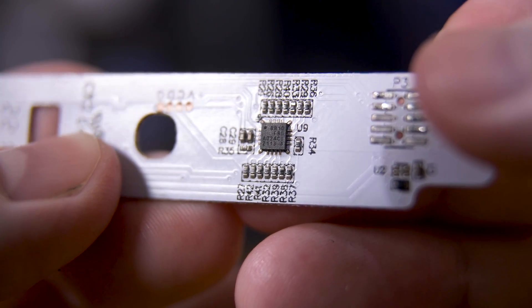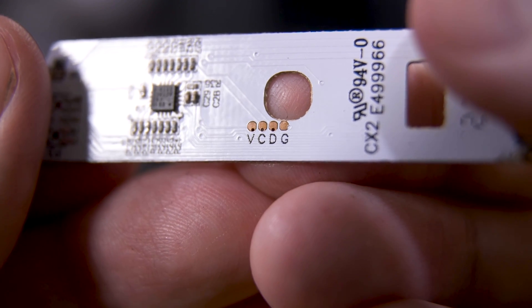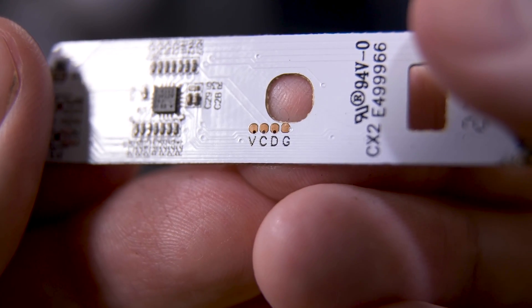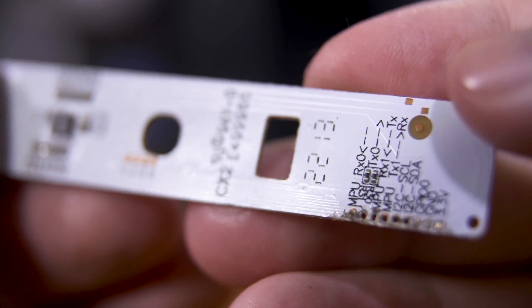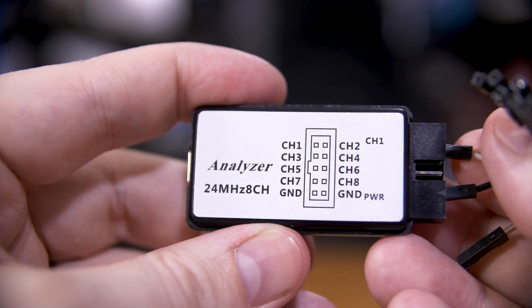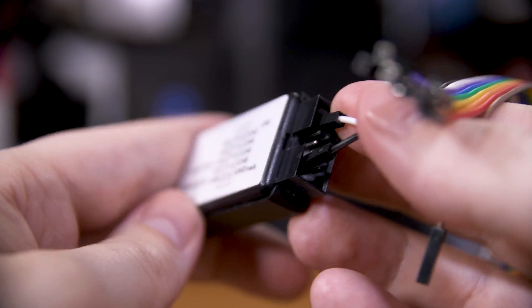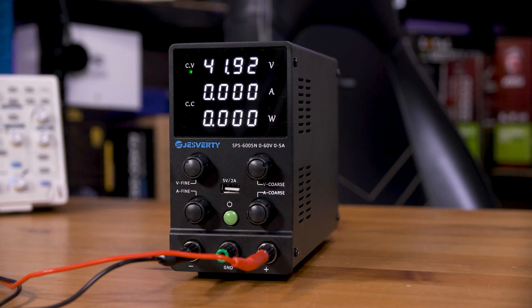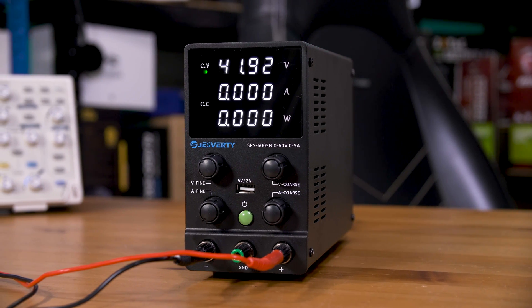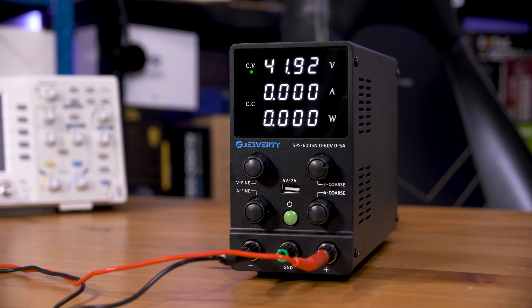Once you have access, you can work out what chips are there and how stuff's connected. In my case, that was to work out that the communications pin was connected to the EFM8 chip. Then you can start probing — use a multimeter to check voltages, being careful not to short anything, even to check what is connected to what with power off. You can use an oscilloscope to look at what's going on, or a logic analyzer. I bought a ridiculously cheap one on Amazon and you can use it with PulseView to capture the UART data — it's a pretty handy bit of kit. You might also want a lab bench power supply for isolated testing. I'll link to everything in the description.